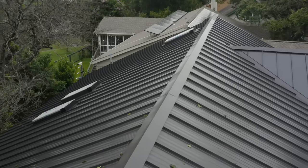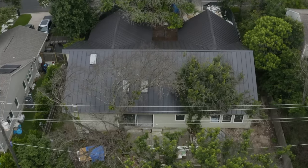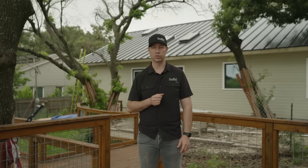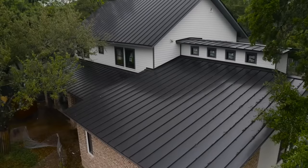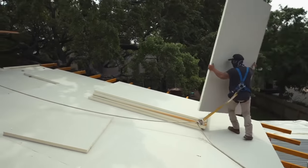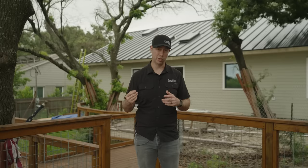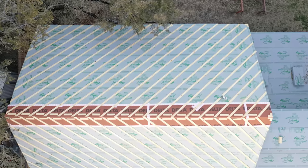When you look at this roof, it's almost perfect — no waves, no undulation. It's right on top of that 5/8 CDX, with a Sharkskin Ultra SA underlayment, which is one of my favorites and Sheffield recommends it for their roofs as well. On my own house, I basically made a SIPs panel out of my roof with two layers of poly iso, then put a second layer of zip system sheathing on top for a solid sheathed deck. Because I don't have airflow underneath that, I put the airflow on top — in between the roof deck and the metal.